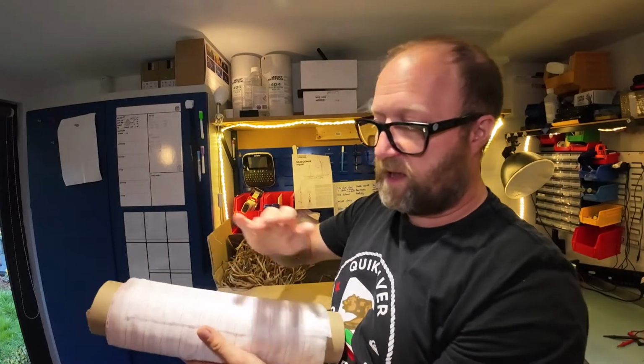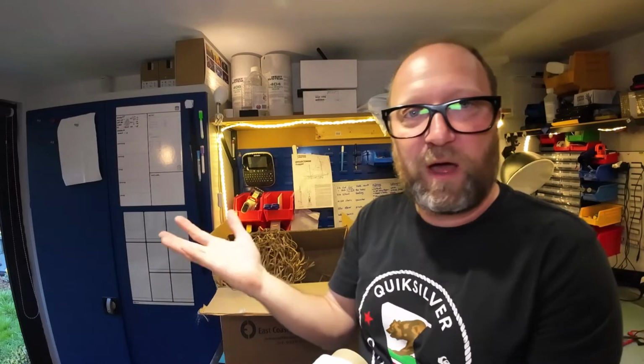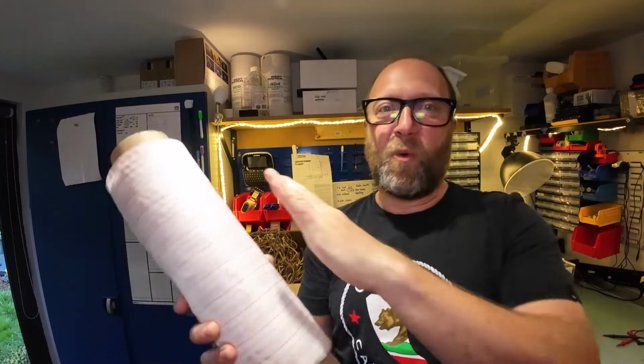The other thing that it does is when you want a finished surface. So instead of what I've been doing with my battery box, where I've been sort of applying the fiberglass and then letting that cure, and then applying a layer of epoxy over the top until it's sort of smooth, but it's not. It's smooth, but it's wobbly and bumpy. Now that doesn't matter for a lowly little battery box that's going to spend all its time in the transom locker. But when you're doing something like Mochyn's new skeg, I want it to look perfect.